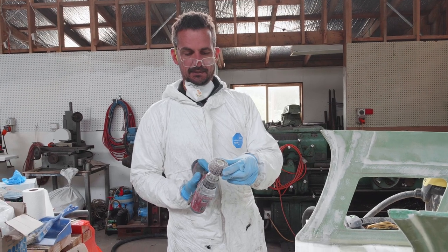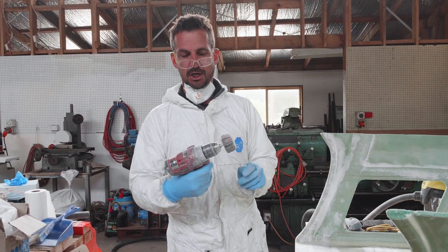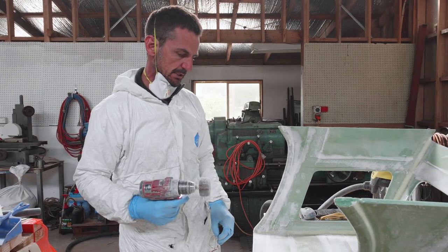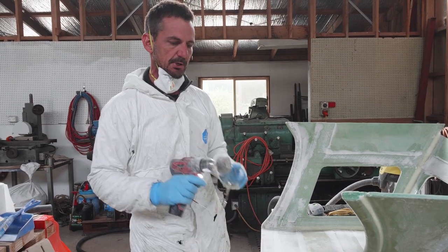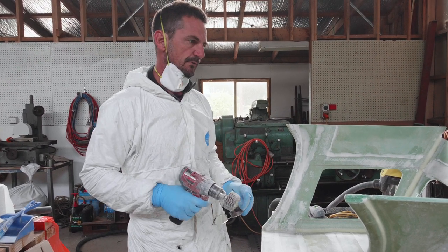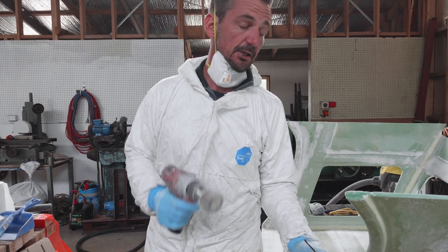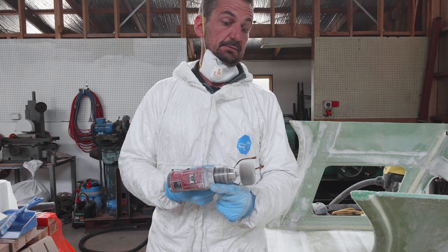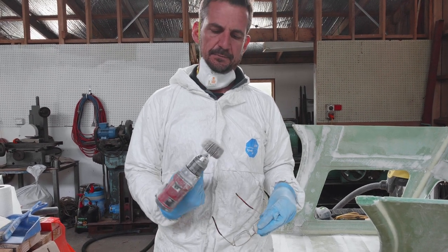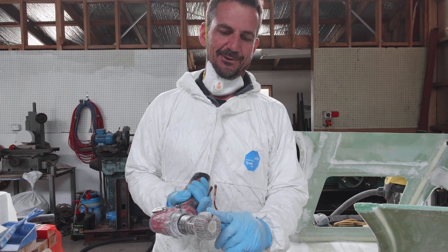If you're considering doing a fiberglass dodger build, one of these little flap discs to go with a variable speed drill gives you a really, really good tool. It's really controllable, it saves you a ton of work, and it can get into a lot of spots. This is a large one but they come in various sizes — three different sizes. We can pretty much do everything from shaping the inside of the windows to getting rid of little high spots where I cut darts. It doesn't throw big sharp particles. If you're putting together a shopping list, these little flapper wheels for drills are great.